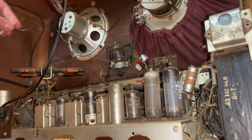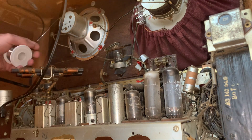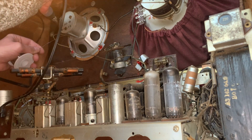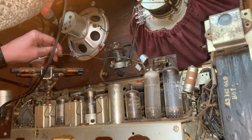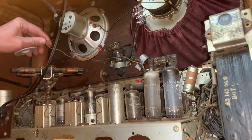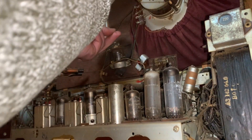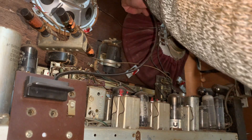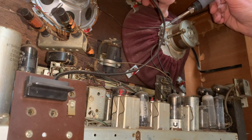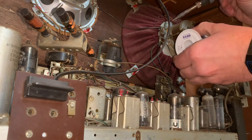Because both speakers are actually pretty big, I decided to just put one on the left channel and one on the right. Originally of course there's a tweeter and a woofer, but we'll just see if that works. Somebody suggested in the comments that I should use flux to solder these old connections, but just heat and pulling is working fine here. Now the woofer is going to get the same treatment — there's actually a contact strip on the back that connects the woofer to the tweeter, so we're gonna break that connection as well.